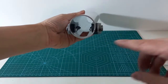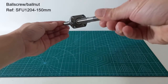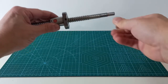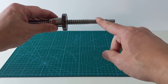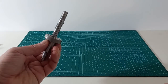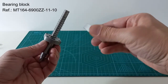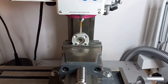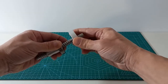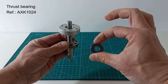Similar adapters are used in the inner part. The ball screw and ball nut model is commonly used in 3D printers. We will remove the threaded part to make it shorter. We will use another bearing block for holding this side of the ball screw, but before installing it we will open a groove for the encoder cables. Now we can install the bearing block, which will take radial loads. We will add a thrust bearing since forces of the ball screw will be mainly axial.